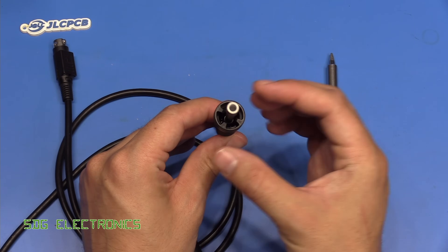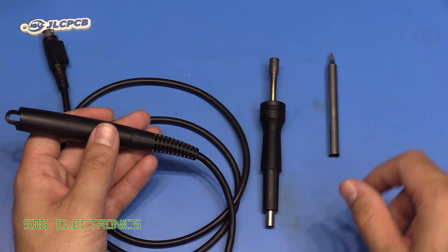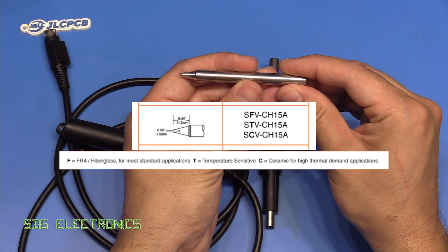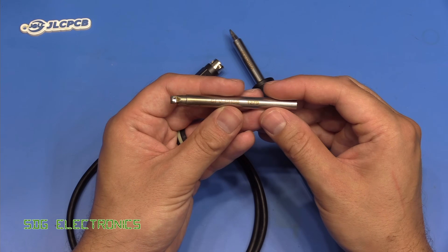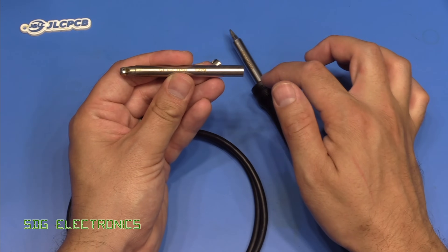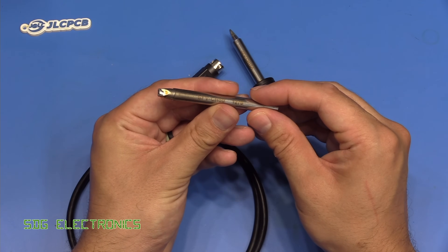You can buy all these parts separately. I've used this quite extensively and haven't had to replace the heater yet, and it shows no sign of being a problem. There are at least 49 tips available, and they are fixed temperature. Each tip type comes in three different temperature ratings, so you can pick depending on your application. Since we're using inductive heating, we're not relying on thermal coupling between heater and tip — the feedback is still provided by the tip. This chunky tip should be able to deliver lots of power into a PCB without the restrictions seen on some other systems.